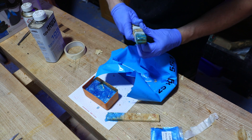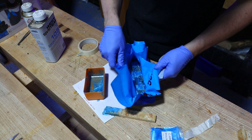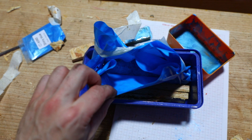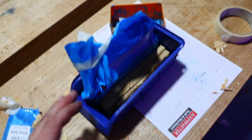I'll tape this shut so I can bring the epoxy line up to the top of that blank, because you can see it's a little bit shy at the moment. I didn't want to put too much in, but if I do that I should get the majority of that blank covered. I've got these bits of OSB pushing it up against the side of the container, therefore raising the level of the epoxy and completely submerging the blank. We'll do the same with the other blank and then see what we get tomorrow morning.